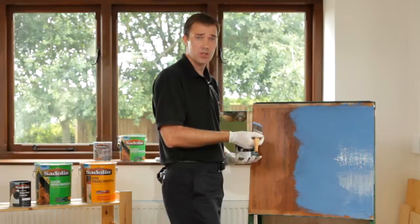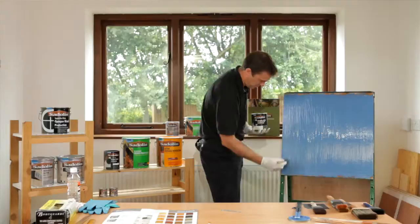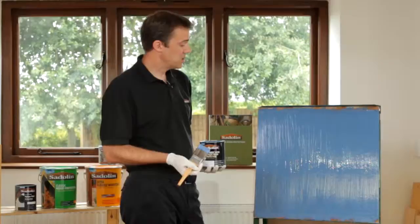With this system, you'll get touch dry after about an hour. However, we recommend leaving it for a 16-hour drying time because of the nature of the formulation — having an alkyd-acrylic mix — which will actually promote best performance. Ultimately, what we're looking for is something that's going to give you up to eight years' protection. Once that's all dry the following day, it's ready for a second coat, and then the job is done.